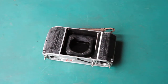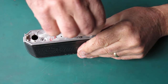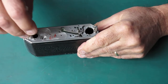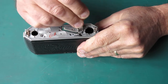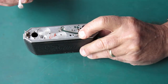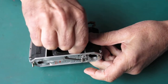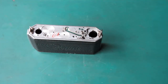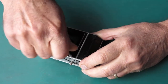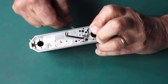The body is quite clean, so this shouldn't take very long. Just need to clean all the way around the casting, taking particular interest where the moving components fit. This wheel is an idler — it couples the shutter cocking rack to the shaft that transmits the action to the front of the shutter. There's a bit of dust in here; you have to get rid of the grease first before you can really see the dust, or check if there's any sand in there.